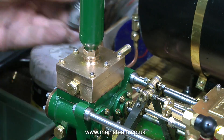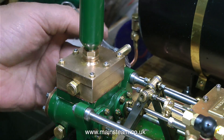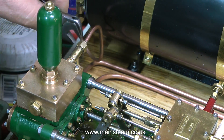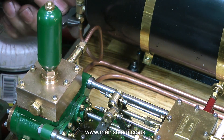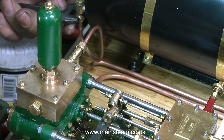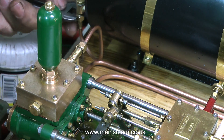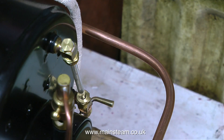The problem is that there are quite a few particles of silicone rubber still left in the water system. I flushed the tank five times and each time got some more tiny particles of silicone rubber, because what I think happened was: when the excessive amount of silicone rubber was splurged into the water chest, it wasn't given time to cure fully before the engine was run. So the water carried pieces of silicone rubber around the system, and there will be silicone rubber down in the main cylinders. It's time to try it now.